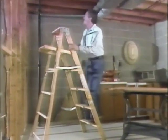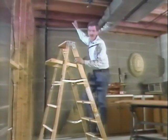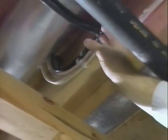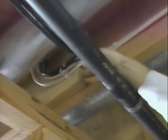All right, let's review what happened during the rough-in. The Romex runs from the service panel in the garage and enters the basement here. 7 circuits supply power for all the rooms in the lower level. Each of the 7 circuits enters through these 4 wires. Starting with the shop, we supply our 2 20-amp circuits using 12-3 Romex and multi-wired for the 4 receptacles.